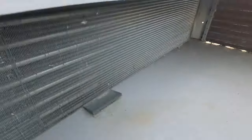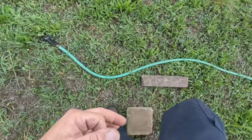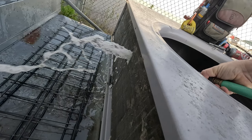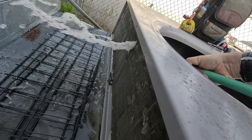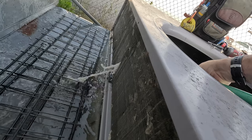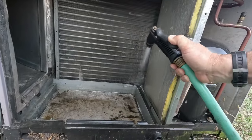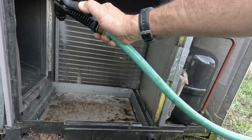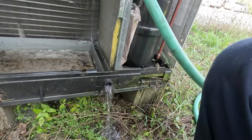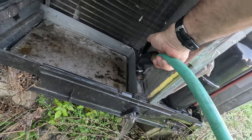He's able to run the garden hose up through that window. Now that could look clean but not be clean, so we may have to yank the blower. We'll see if we can get through it with the hose. Most of it's all coming out through the drain. If we've got good suction pressure, we'll know that we aren't restricted too badly.